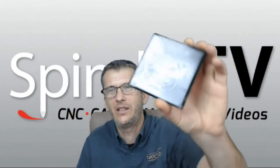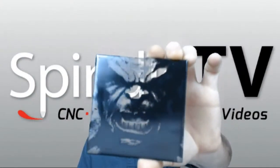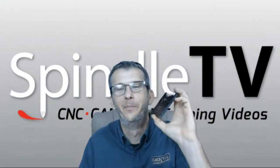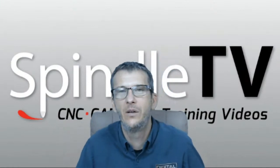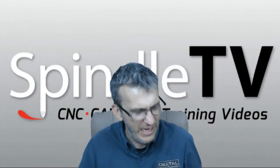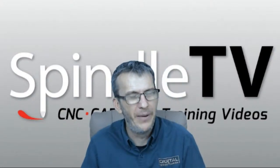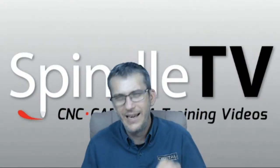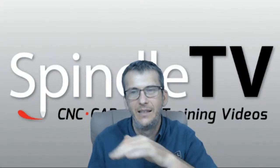The Hulk, which I didn't get the good result. You can't see the green because of my green screen. We're actually looking through the tile. It's an invisible tile. But I didn't get that brilliant result that Garrett got in his video. But still, it was an hour and 29 minutes to laser engrave that. I went finer lines. You'll see when we get into the Vectric here and all. But I should have gone with a little bit more power setting on the laser and possibly a little bit slower to really get through that black and then the green.